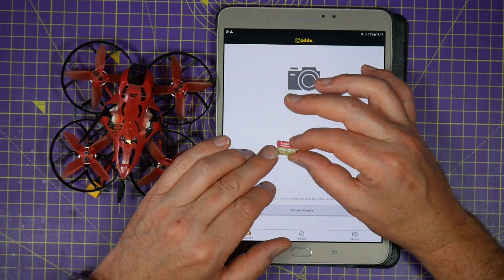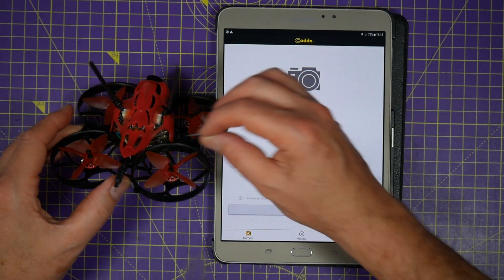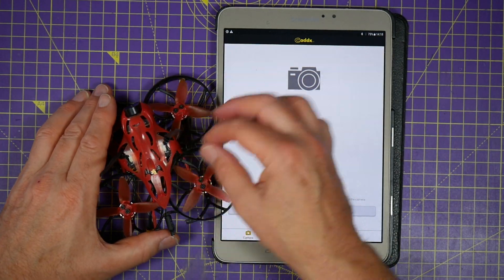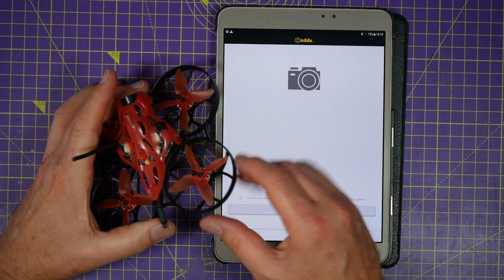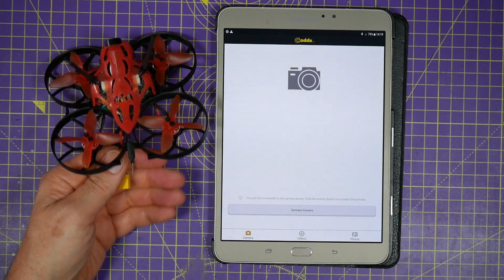That's a weird combination because on Windows you can't format anything bigger than 32 gig with 64K blocks, so you'll need to use a separate program. Grab yourself a copy of GUI Format — I'll leave a link in the description — it's a free Windows utility for formatting FAT32 storage over 32 gig. Make sure you've got the SD card drive selected and the allocation unit size is 65536 (that's 64K), choose quick format and hit start. After a few seconds the card will be formatted. Now we've got that all formatted up and ready to go, just plug it into the SD card slot on the bottom of the DVR card.